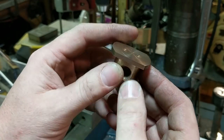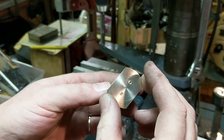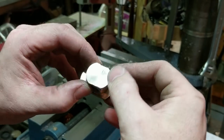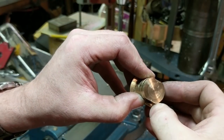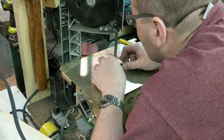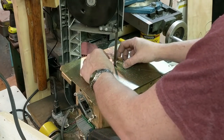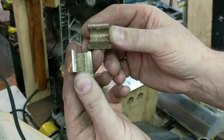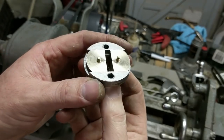A little quick review of the part at this point. Now all we have to do is split it down the middle. I'll use the spot drill on the centerline to drill two tiny spots, then strike across those with a scribe — that gives me my line for the centerline — and just use the band saw to cut it. The truth is, as far as precision goes, the perfection of this line is not relevant to the function of the final part, but it's going to look hokey if it hasn't been done cleanly.